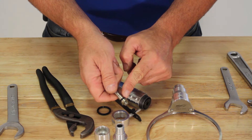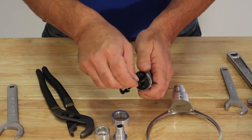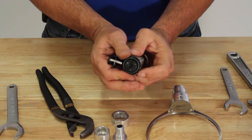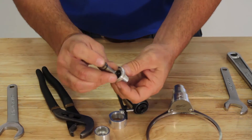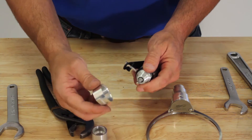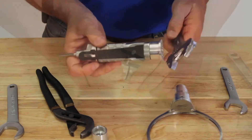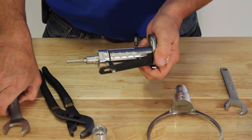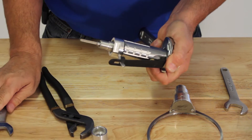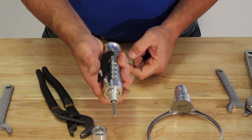Make sure that the U-cup is facing down toward the spindle gears. Replace the O-ring — it will need to be replaced if air is leaking by the motor nut. Press the drive shaft back into the drive shaft housing and reassemble the motor nut to the motor. Do not over-tighten, as this is an aluminum part and can be stripped out. Once the motor nut is back on, attach the air and test the motor before moving forward to make sure it is running properly.